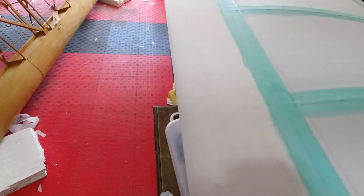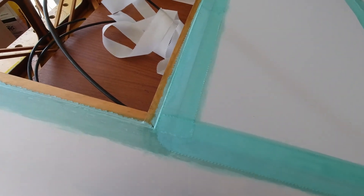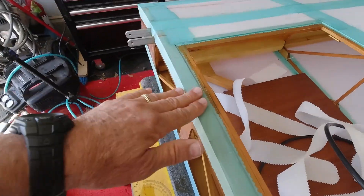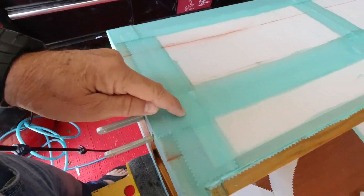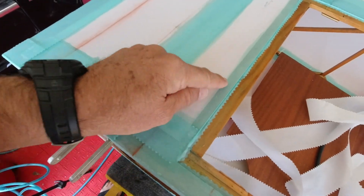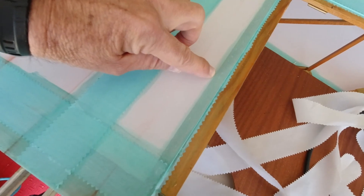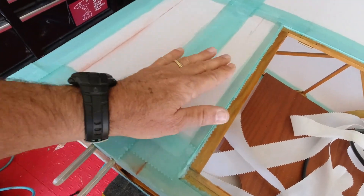When I got to the tank area it wasn't really necessary, so this one just stops here — there's no need to do it over this area. But back here that's the rear spar area, and then we've got this edge right here, and I have one more to put on — that's the back edge of the tank area — because the fabric is resting right on the edge of the wood here, and that's what we're trying to protect against.